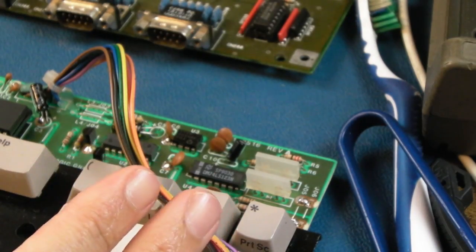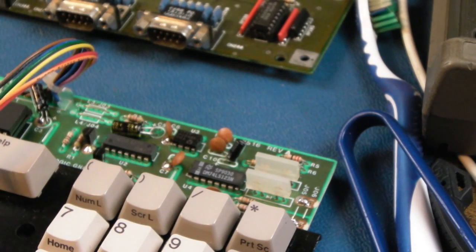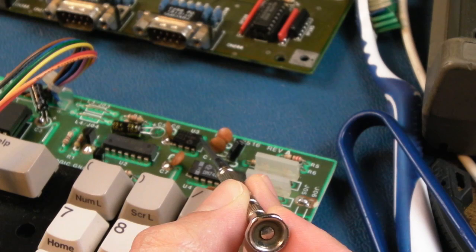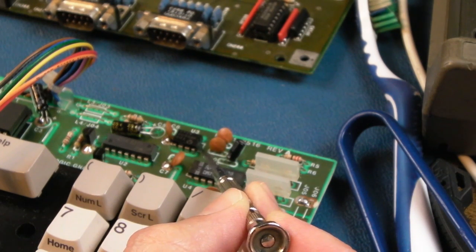So a quick test of this, it's doing exactly what Anthony described, which is the red caps lock LED just stays on and doesn't do anything. I've tried the other chip as well. Now, this is something I've just spotted. I actually think this 555 timer's on upside down, because if you look at the silhouette there, you can see a square edge. Yeah, there's no pin 1 marking.